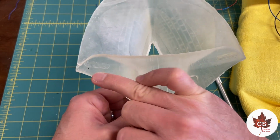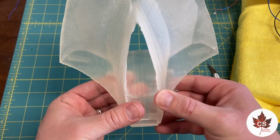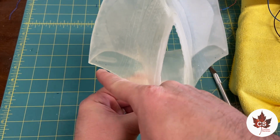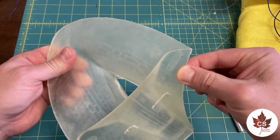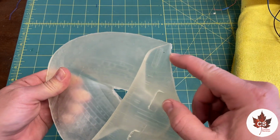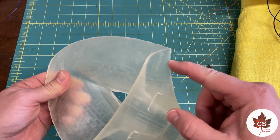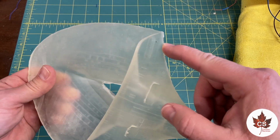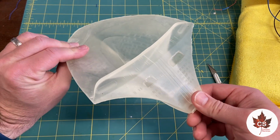and here, if you can see those little black dots on the underside, there are two 0402 SMDs, which will go on either side. But you can see where these go, that is solid resin. So I'm going to have to channel inside here in order to be able to get those 0402 SMDs in place. I may need to oversize the hole a little bit so that I can run the lights in a little bit easier, to give myself a little bit of extra wiggle room.